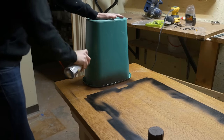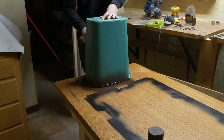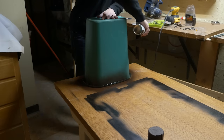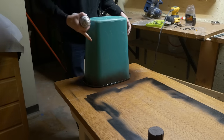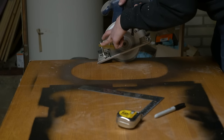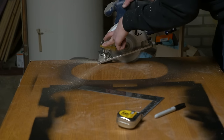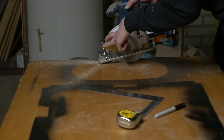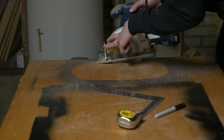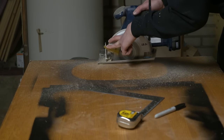It also helped me line up where I wanted to put my surface-mounted garbage can, which I could also spray paint to capture the outline of the lid. After this, I took a square and traced a rectangle on the inside of the opening of the garbage can, and with my circular saw did a freehand plunge cut into the door to cut the opening. This cut was tricky — be careful doing it, not only because it's dangerous, but also because it's almost impossible to get a straight line. I should have used a guide here, but I didn't. Don't be stupid like me.